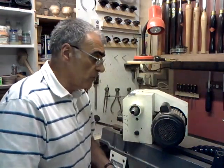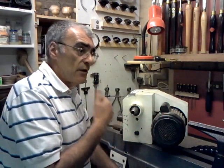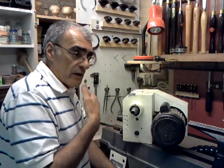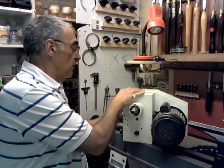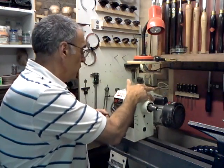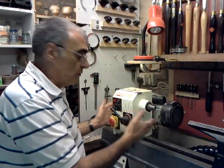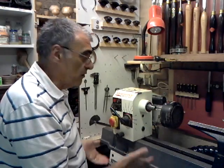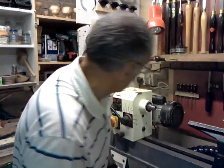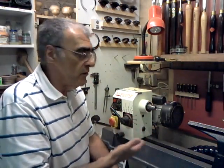There are schools of thought that say if the headstock is moveable, it's another moving point that can wear — which is true because it's obviously on a pin and it lacks rigidity. A solid head which doesn't move is normally made out of solid cast iron, so it's attached to the machine and it's more stable. I haven't had a problem with this, but then again I'm not a professional turner.